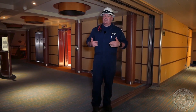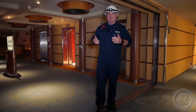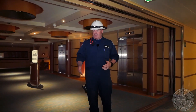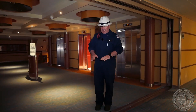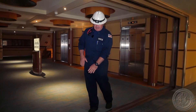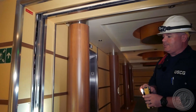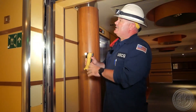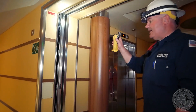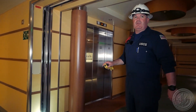Right now I'm in between two main vertical zones on board the ship. When this door is closed, it effectively segregates the two vertical zones from each other. Before testing the door, I'm going to inspect to make sure everything looks good. I want to make sure the threshold on the deck — if there's carpet, it acts as the fire stop between the carpet. If it were tile or cement flooring, there doesn't necessarily need to be a metal threshold. I'm going to check up inside the internals. This is a pocket-type door, so the door is actually in the bulkhead. I can see in here and check the operating mechanism to make sure it's clean, free of dirt, debris, and trash. This is a passenger vessel and sometimes passengers put trash anywhere they can find. I want to make sure this door looks like it's going to operate unobstructed.